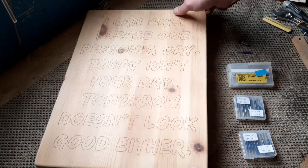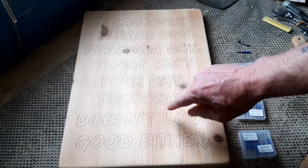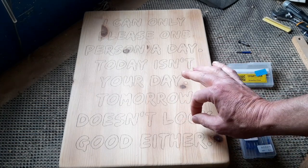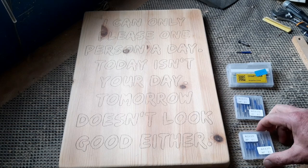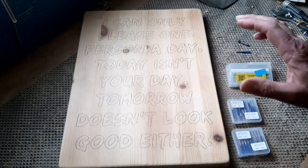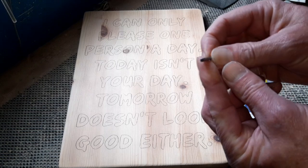That's all we need to do our little project today. As always I like to use CNC bits to do our lines. We're going to do inset lettering, so we move the inside. If it was outset lettering we'd move the outer background so the letters would be raised, but we're going to do inset. I'll fill these with resin or paint and sand over it nice and sharp. CNC bits — 20, 30 degrees, 15s or 10s — simple eBay or Amazon, and you get a lot for your money.